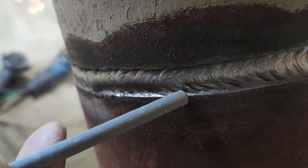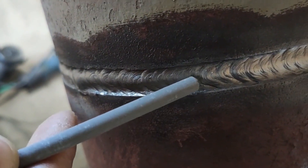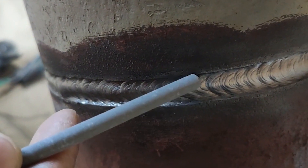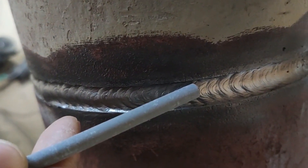The fifth point is the difference in ease of use. All welding parameters of the cold welding machine are controlled by the machine's microcomputer, so the welding joints are uniform and beautiful and operation is simple. No professional welder is required — people without operating experience can achieve good results after simple practice. The technical requirements for welding personnel are lower than for argon tungsten arc welding.